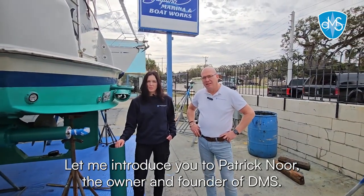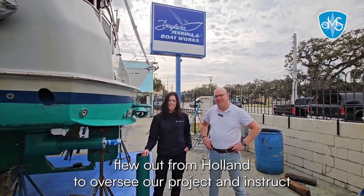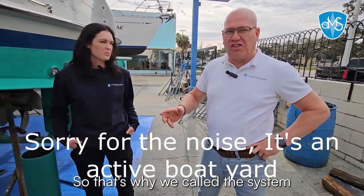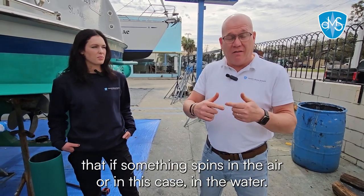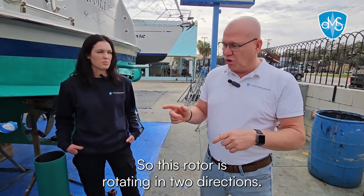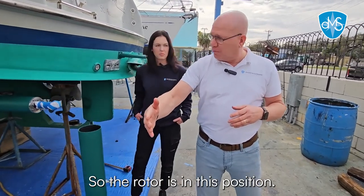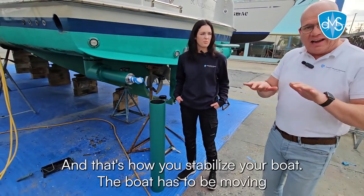Let me introduce to you Patrick Knorr, the owner and founder of DMS, and his project manager, Lonnie. Patrick and Lonnie flew out from Holland to oversee our project and instruct the boat works on the installation of the MagnusMaster system. Yeah, the system is working on the Magnus effect, so that's why we call it DMS MagnusMaster. The Magnus effect is that if something spins in the air, or in this case in the water, it creates a very big pressure up and down. So this rotor is rotating in two directions. Now it's in the park position. When the system goes out, the water is flowing over that tube, and because it spins, it creates a very big pressure up and down. And that's how you stabilize your boat.